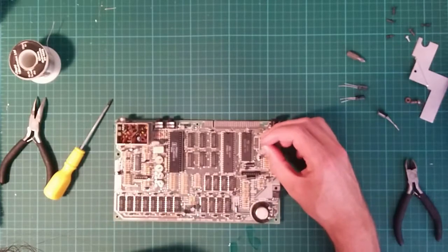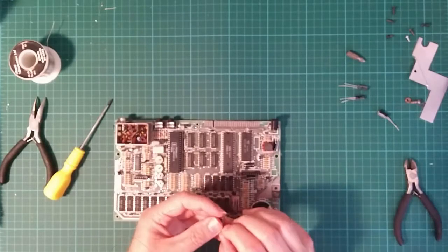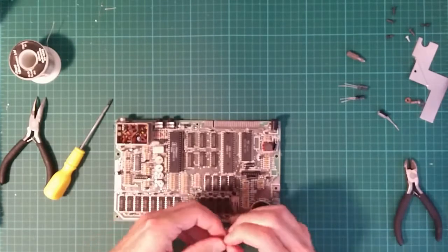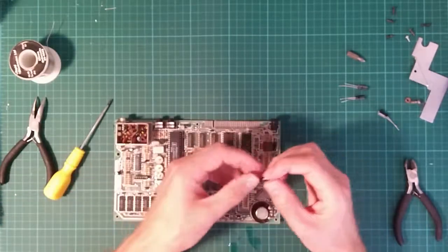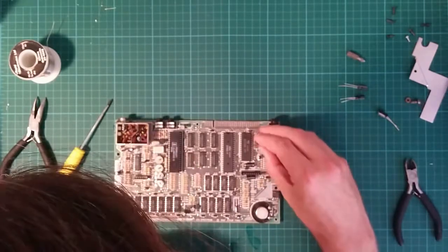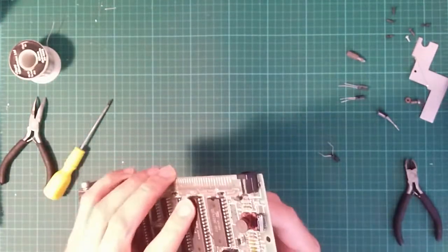So that wants to go in here. But we've got all these tracks in the way. The positive goes at the top. So it looks like we may have to do our bending over thing again. There's really no space, the wires are too small. So I could easily spider it above the board slightly, there's probably room. And the wires are stiff enough to keep it clear of all these other components below. So I mean, it's not brilliant, but it's what we're going to have to do. But the age-old problem, there's stuff in my holes.